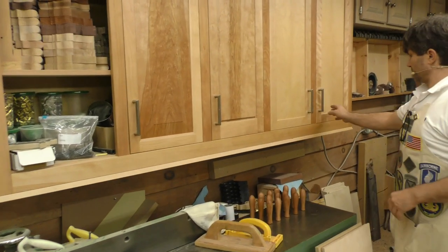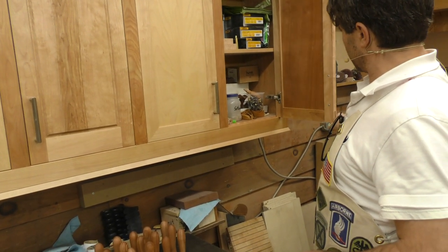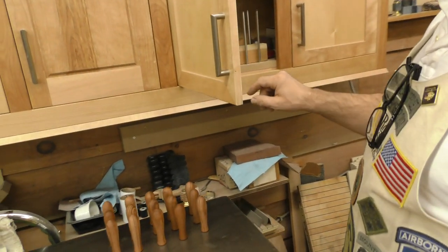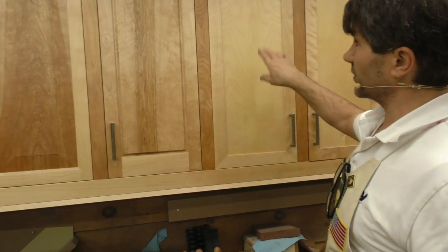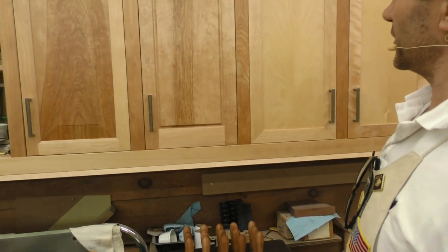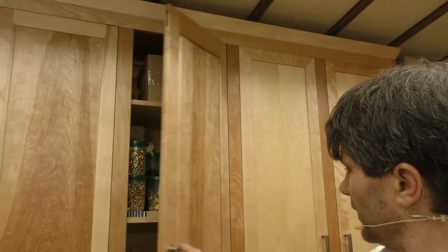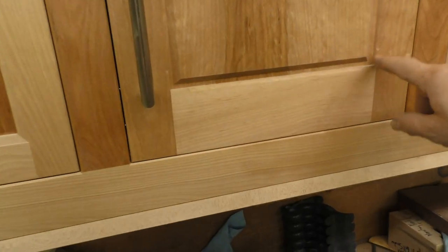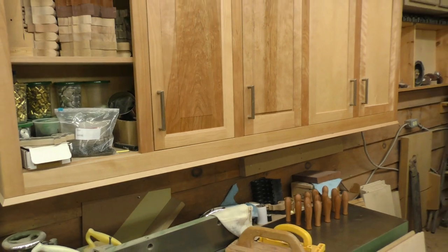These two are simple — just quarter inch plywood panels. This one is kind of an open mortise and tenon where this piece comes all the way through. This one is mitered with two splines — a nice strong joint. The nice thing about the miter is if you had any decoration on the inside, you carry that decoration all the way through. This one took the most time: it has through wedge tenons, a very strong joint. The panel has a chamfer that stops right here and picks up again there — way too much work for a shop, but fun nonetheless.